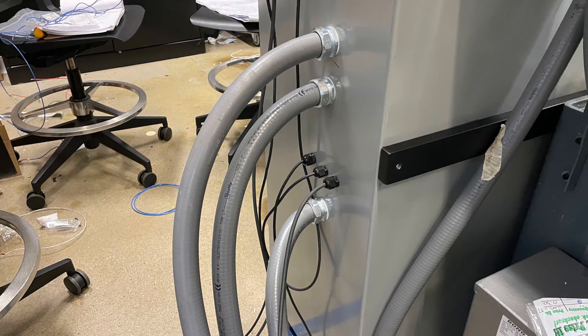To protect wires run between any of the panels — the new panel, the old lathe panel, the HMI panel, or the transformer box — insulated conduit was run between them. This helps protect wiring from environmental damage, as well as separating 24-volt, 120-volt, and 480-volt wires, which are run through separate lines of conduit even if being sent to the same location. This helps protect them from interference between each other.